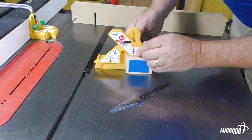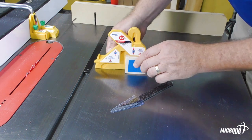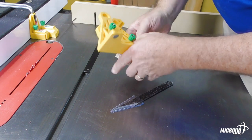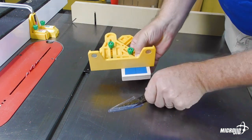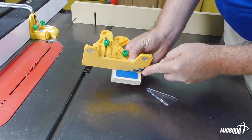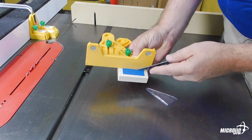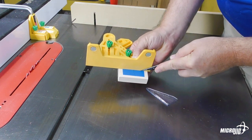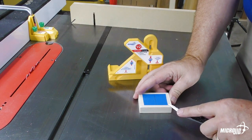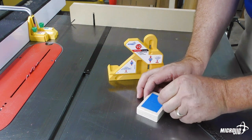The most accurate marking will be done with a flat-backed marking knife. The marking knife will leave a line so thin it won't be visible here on camera, so the blue tape will show the cut. The tape is being cut from both ends to show that the FitFinder has truly found the center of the part. Peeling back half the tape shows a perfectly straight, clean line.